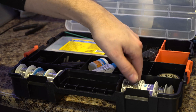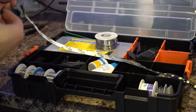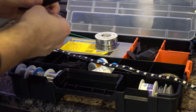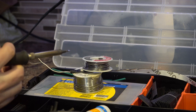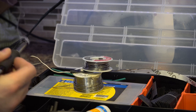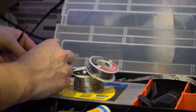Now we can solder and heat shrink our wires. I always like to heat shrink them because it kind of waterproofs them at the same time. Generally I'll take a smaller heat shrink and put that over top of the actual connection, then do another bigger one on top of the whole thing as a sleeve to encase everything. When soldering, I like to pre-tin the wires — just get a little bit of solder on them to make it really easy to stick together later. We'll separate these a bit and slide it down the line so it doesn't get too hot and shrink as we're soldering.